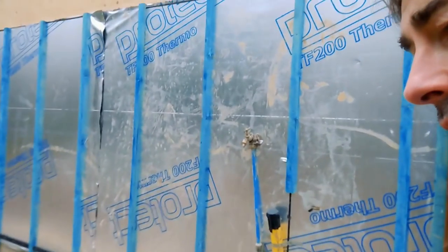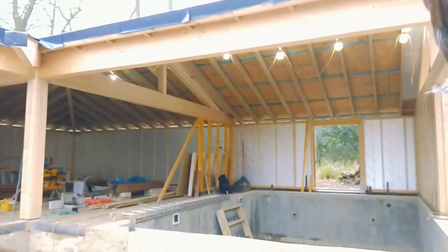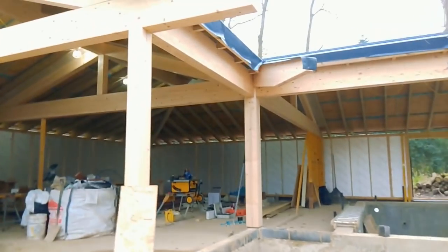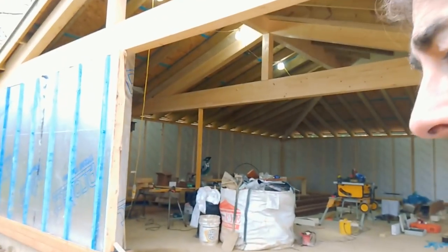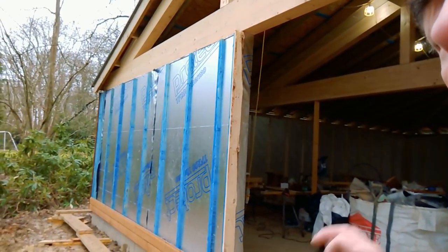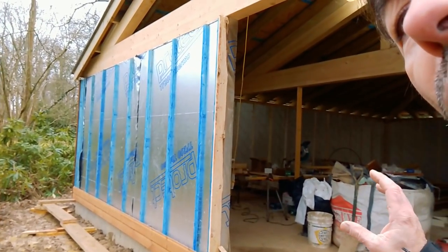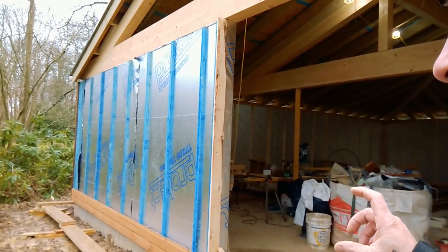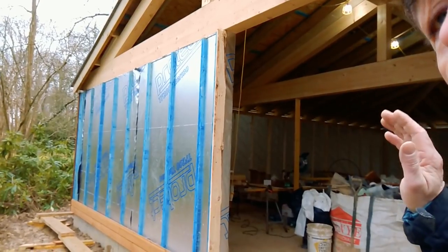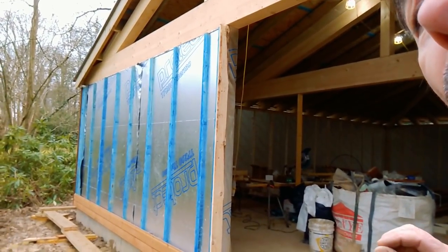Moving around to the front — mainly glass, but there is another area of cladding here which we're just working on now. When you're using a tongue and groove board you want to start at the bottom. In an ideal world you want to ping every line and course them — the cover of this board is 110mm, meaning that's the distance it travels as a row every time it goes up, even though it doesn't measure exactly that because it allows for the two mil gap.